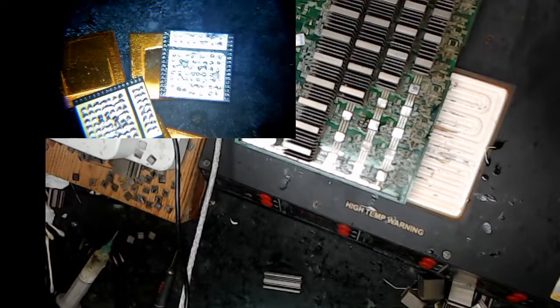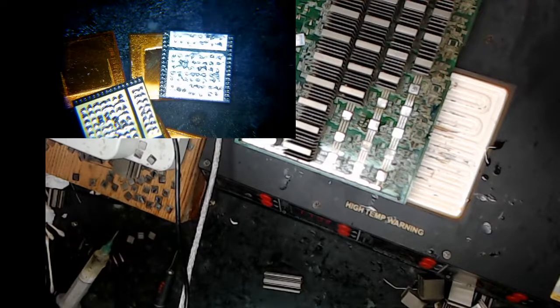They have a heat gun pointing straight up. I don't have that, so I have to hold my heat gun. But what they do is they hold the chip in the tweezers, heat up the chip, and then go wipe it off on a paper towel, and it's like instant clean. I basically have to put mine in a clamp, a vise, and then I use flux and a wick, and I clean them off. But at least I know they're clean like I want them to be.